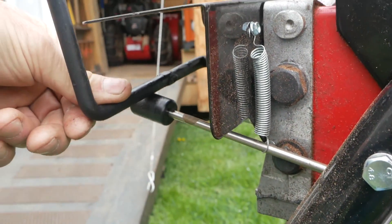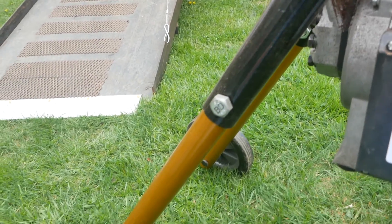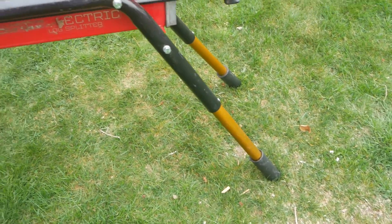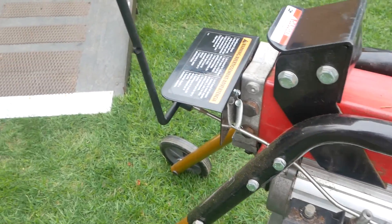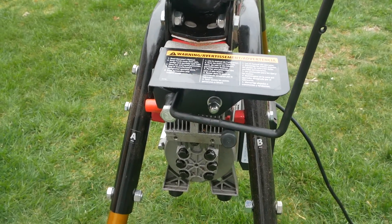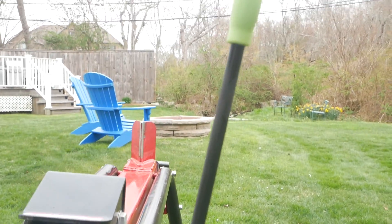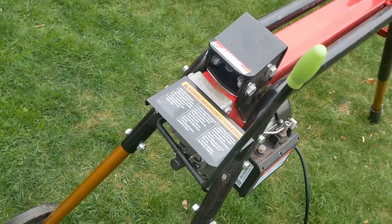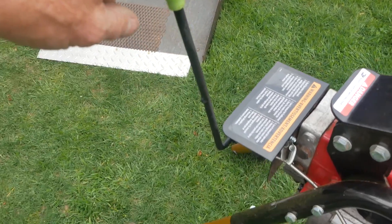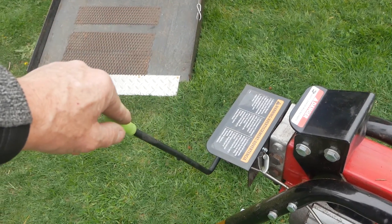Now I've got that lever coming across the top of this bar that I made. When the lever goes down, it does both - it pushes down on the switch and starts the motor. Even though I had put extension legs on the Earthquake log splitter, I was still bending over to hit the switch. So yesterday I decided to weld on an extension - now in a standing position I can easily just grab this handle and that starts and stops the log splitter.